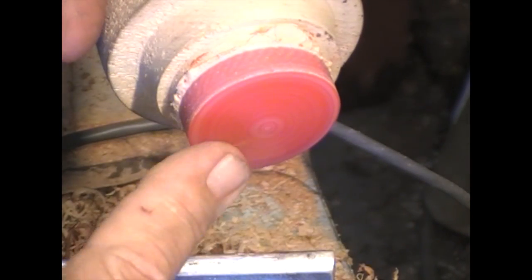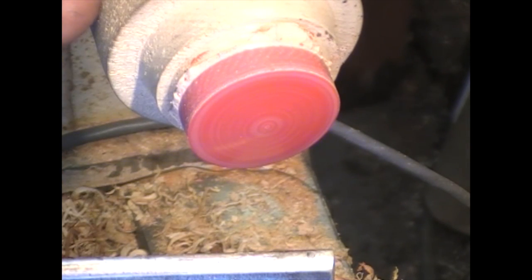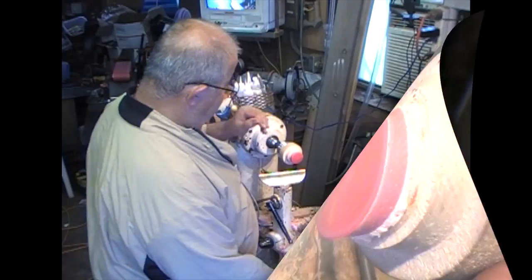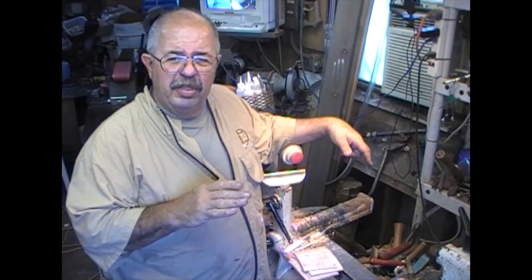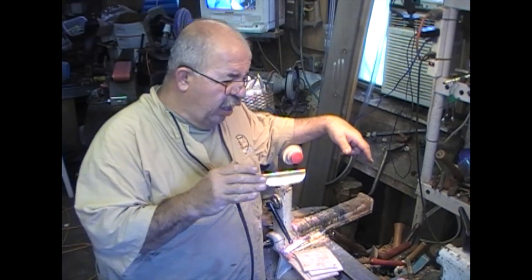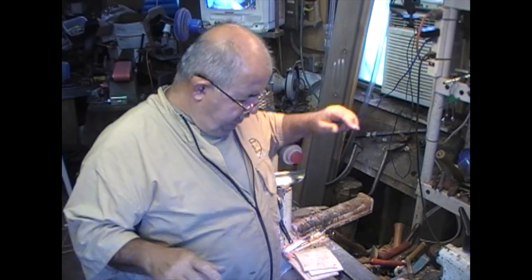Corian's got fiber. By saying I can go to 800, you're short-cutting your work — you really are. You take a cut with a skew, gouge, or carbide cutter, look at it and say, 'Man, that's great, smooth as a baby's butt.' Well, no you didn't. You cut nicely, but some of your cut may be laying fibers down.